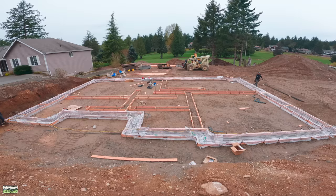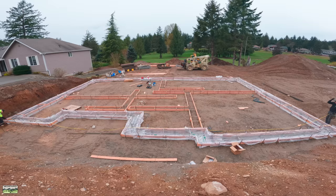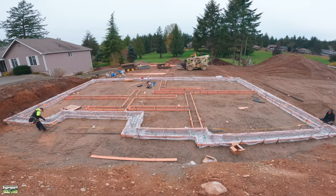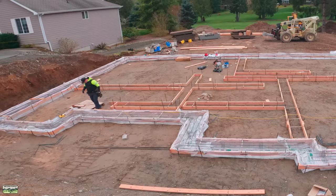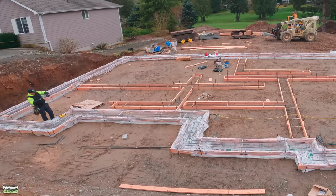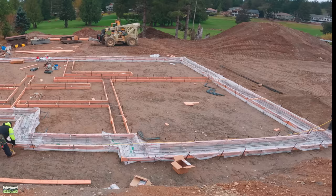This is the same process if you're snapping lines on top of a slab or your floor. What we have to do though is run a dry line or a string line from nail to nail across the back and across the side. Kyle is going to cut a foot so he's going to hold the one-foot mark on all of those, and then I'm just going to mark on the footing boards what our number is. The house is 64 feet - I'm going to mark 65 feet while double-checking the plans. We're doing all the east-west walls parallel to the right walls. We tack nails because that's actually our wall layout. After we pour concrete, we're going to set clips - all we have to do from those nails is snap a line or run a dry line. We're going to work all those east-west walls off of our right-hand wall reference point.